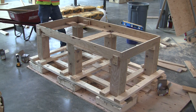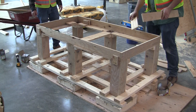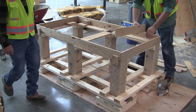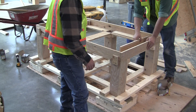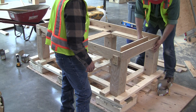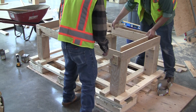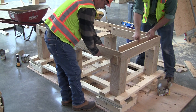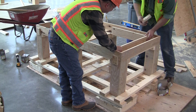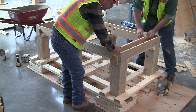What we're going to do now is we have a bunch of these smaller pieces cut. We're going to end up cutting some more cleats. We just want to form the inside. So we've got to take these panels and we're going to start to form the inside of our beams. Then we'll take a cleat and put it right in the corner to hold all this together.